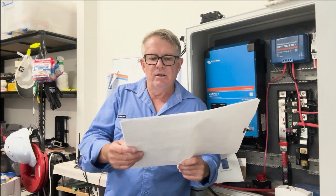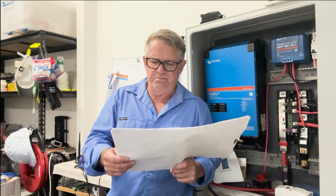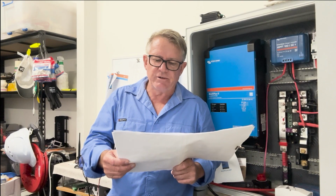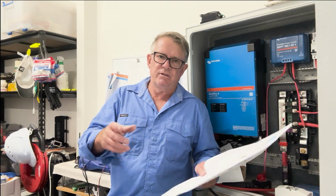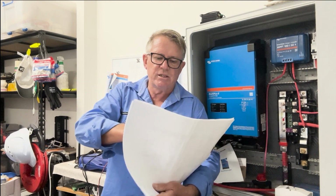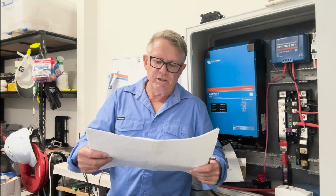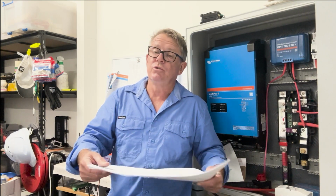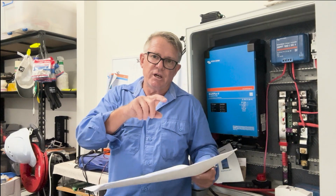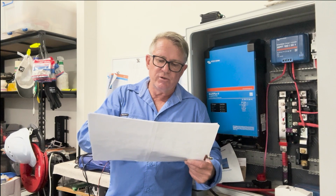We've got bridge lights, navigation lights, bridge spotlight, VHF radio, compass and stereo. They're all the things that I've taken into consideration. They've all been fused, they're all protected, and they're all switched. All right, and then down on the deck, I've got two to the flybridge, so I'm protecting the flybridge with a fuse and circuit breaker down on the deck, as well as all these other circuits.